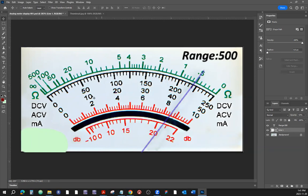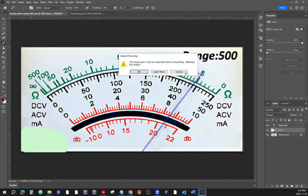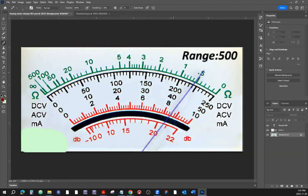This is the scale that we have chosen, from 0 to 50, so the scale of 50. And this is the range that we're set up with, and this is the swing out of the needle. Remember, throw the range on the scale. First thing we have to do. The range is 500, and we throw that on the scale of 50. What do we get from that? That is going to give us 10. Now, 10 is our multiplier.